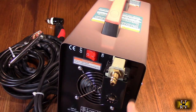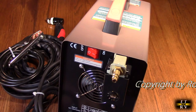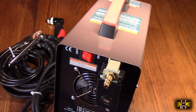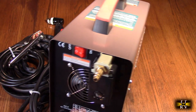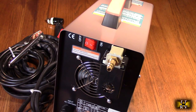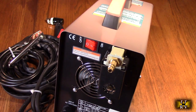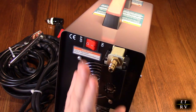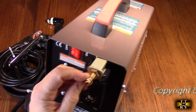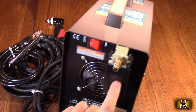As your incoming air comes in and gets compressed, water will form, and this drain plug allows you to take the water out of the system — because obviously you don't want water going into the nozzle when you're trying to get high-temperature cutting action going. On the back there are all the specs telling you about what power and current you need, the power factor, and so forth. They got this to run really efficiently, and this connection here gives you the ability to filter the water and keep the inlet clean.